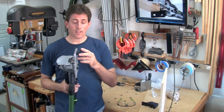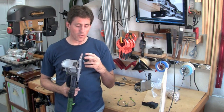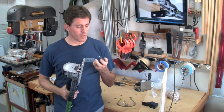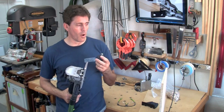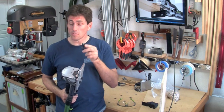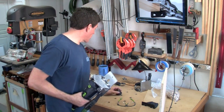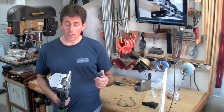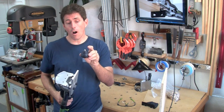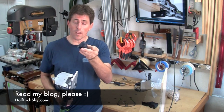Now for the handle, all it is is a part that comes with your clamping elements. Most of us have clamping elements, and most of us looked at these handles and thought, oh, that's nice, and we used it on the first clamping thing, and then we realized, well, the clamping element doesn't pop out of the table anyway, so we put these away in a drawer. The question for you is, which drawer? So all you need to do is either put a pair of washers on there to act as a spacer if you just want to get going and using it right away, or just go to the store and pick up a 12 millimeter long M8 screw and then just swap it out of the handle that you have.